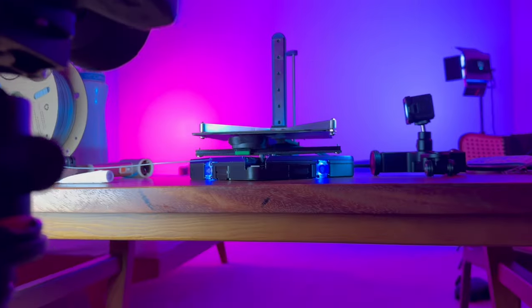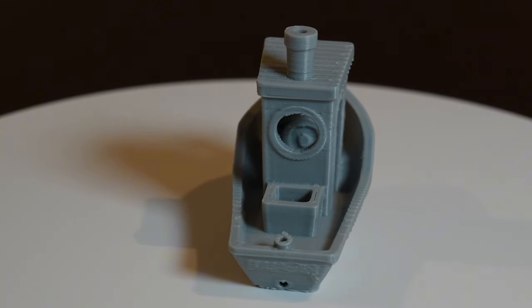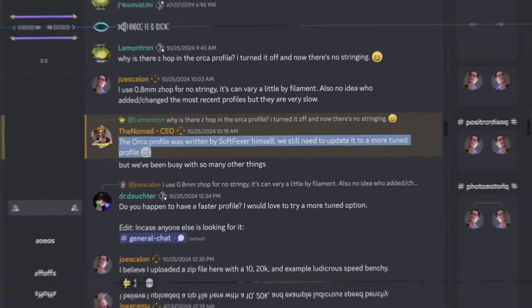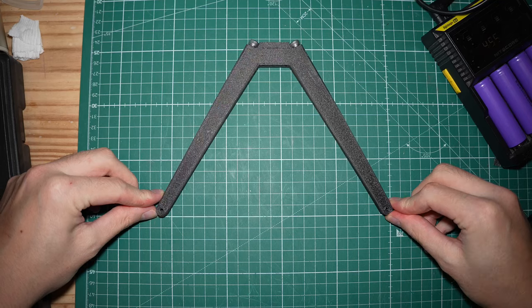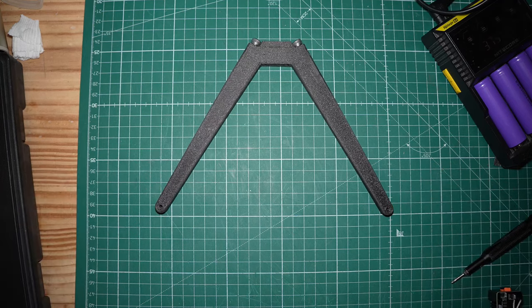Let's take a closer look at the sample prints. I noticed they have a lot of stringing, so although I went ahead and filmed a bunch of time lapses, I did go back afterwards and try turning off ZHOP — and that fixed the stringing right up. I posted on the Positron Discord asking why the Orca profile for the Positron had ZHOP. Surprisingly, that profile isn't optimized at all, with Nomad saying it was unfinished and slow — they intend to improve it a bunch but haven't had the time. I'll be tuning in to their tuning updates and I'll keep you posted. I'll admit, maybe I was too quick to give up on the 3D printed bed holders — I think I just had more rigidity in mind than is really needed, so I'll definitely give that another go before the next video.